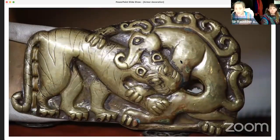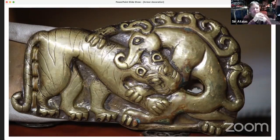So would you just put the epoxy on the back like butter and then rivet it down? Well, I waited for it to cure a bit. For this one, I mixed my little epoxy and poured it in and encouraged it to go into the different areas where I needed it to be supported, and then let it set. Hopefully it's going to be level-ish when it's done and not overspilling. Then I just let it sit and then stitched it to my piece.